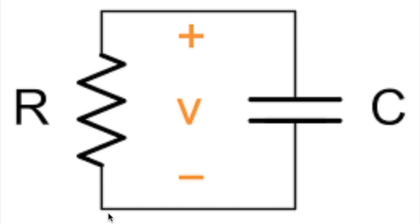Voltage is the driving force pushing electrons through the circuit, and the total amount of electrons flowing is the amperage. The voltage pushes electrons through the circuit, hits the coil, which slows down that current. The higher the resistance, the harder the battery has to work to push through faster. Coils glow because resistance builds up heat energy. By the time electricity exits the coil, it's at a lower amperage — most energy was resisted by the coil — and it flows back into the battery at lesser amperage on the negative end.